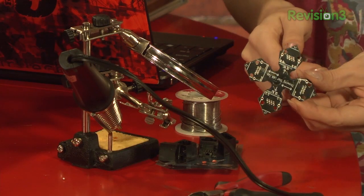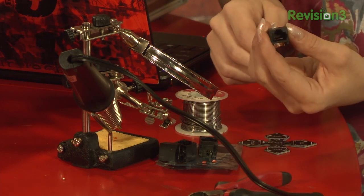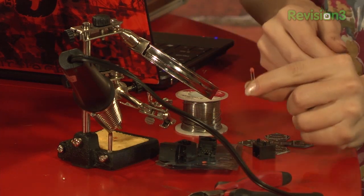The tap comes in seven pieces: the printed circuit board, four modular connectors, and two capacitors. Normal gigabit signals travel in both directions and it's impossible to build a completely passive tap. There are gigabit taps, but they're like a thousand bucks, so no thanks. To overcome this limitation, the Throwing Star gracefully degrades the signal with these two supplied capacitors that force the connection down to 100 megabits by adding a slight noise into the line.